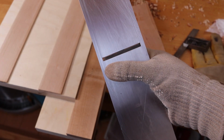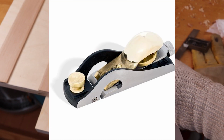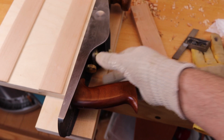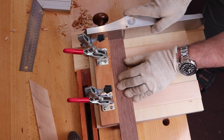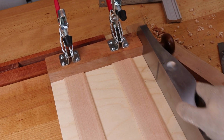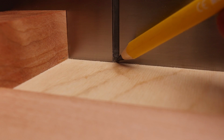The hand plane recommended for shooting boards is the low angle plane and not the rabbet plane. A low angle plane will effectively cut through the end grain, and the edge at the side of the plane will be registered against the shooting board edge to prevent the blade from cutting through it.